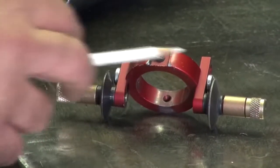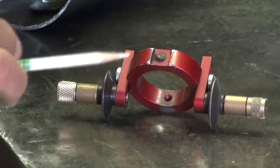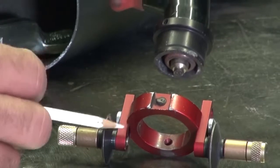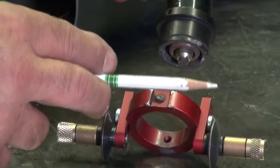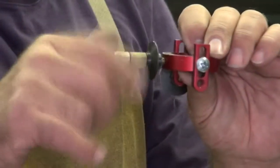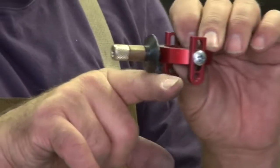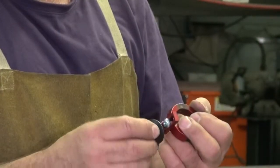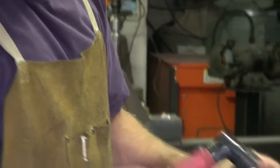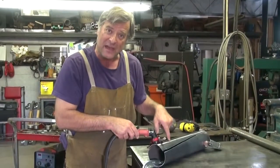So, this is what they are. Here's the little collar that goes on the bushing that goes on to the plasma cutter. And these are the little extensions that help to move the wheels down a little more. They make up for the roundness of the pipe. I would normally use them here to work on a flat piece of steel as you move along, but because of the roundness of the pipe, you have to extend them down just a little bit so your tip won't drag on the pipe.